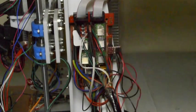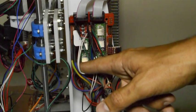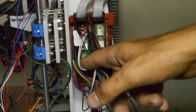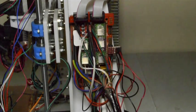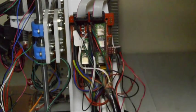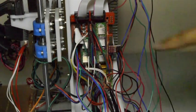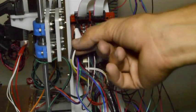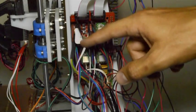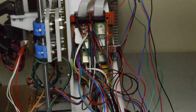Now we will connect the stepper motor connectors to the stepper drivers — using the two stepper drivers on the left-hand side. Where your previous extruder motor was connected, connect motor one (the motor on the right-hand side) in the same orientation as previously. The motor on the left-hand side connects to the top stepper driver with the connector flipped around because the gear needs to turn in the opposite direction. For thermistors: the bottom pair of pins is for extruder one (right-hand hotend), above that is the heated bed thermistor, and the top set is for extruder two (left-hand side).